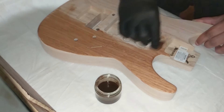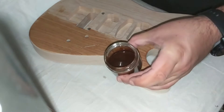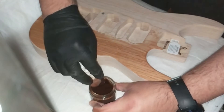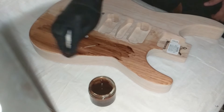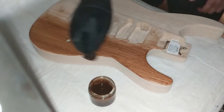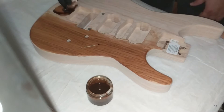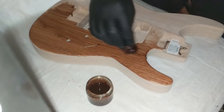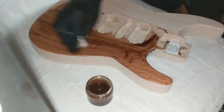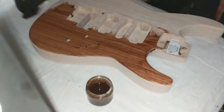I've added a little more color to this, so let's see if this gets a little darker. You can keep adding more coats to get it darker, so no need to worry if it's not quite the right color the first time. And if you go too dark you can always sand back. I want to try to keep the strokes even so as not to leave smudge marks. I'm not too concerned right now since it's the very first coat. Make sure you pick up any spillage on the sides.